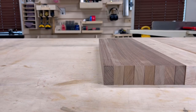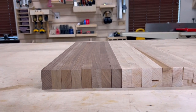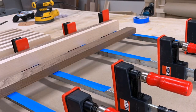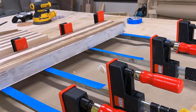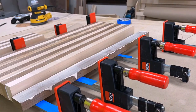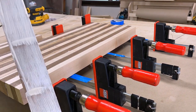Once you finish your planer work, you should end up with 16 boards that look like this — and man is that satisfying to look at. For the first glue-up, we're going to be mating a walnut board with a maple board. If you look closely, I'm only applying glue to the walnut board. So even though I'm clamping all these together at the same time, there's only mating pairs that are actually being glued together. This will help us create the right pattern in the next glue-up.